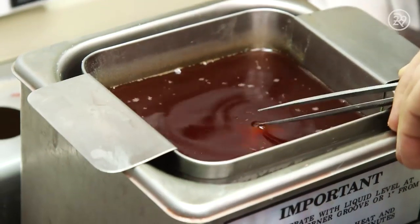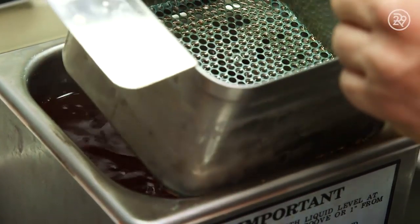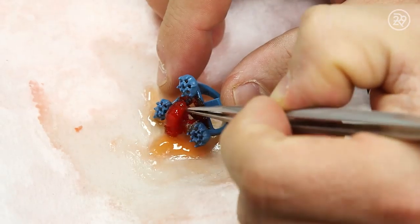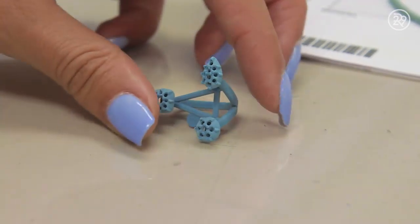The model is put in a bath containing a special cleaning solution. Then, tweezers are used to remove the stubborn bits of the surrounding red wax. After several minutes of washing, the final blue casting wax is revealed.